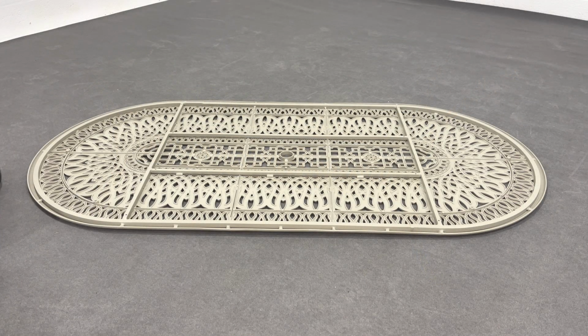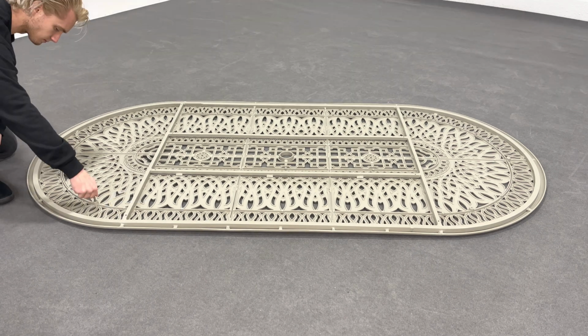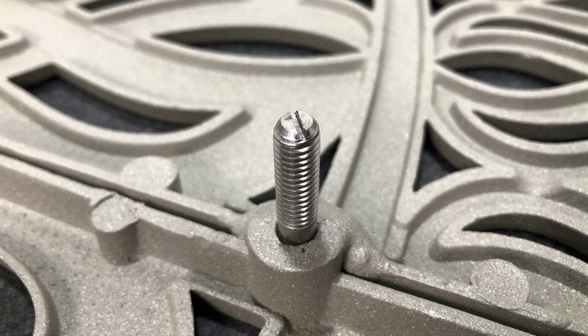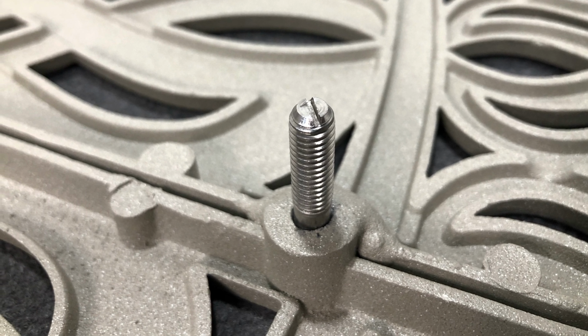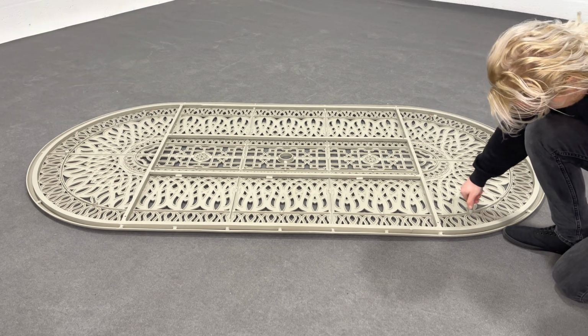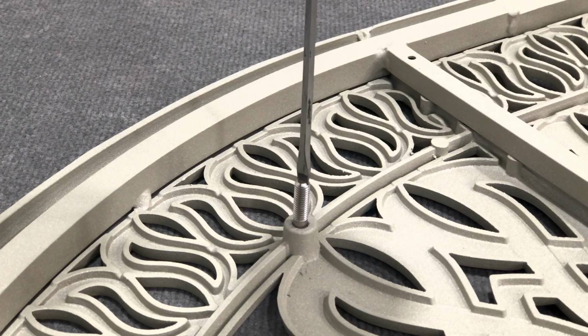On a soft, clean, flat surface, place the tabletop face down and attach the bolts. Pro tip: when attaching these bolts, ensure the screwdriver thread is face up. Repeat this process for the remaining 3 bolts. Once completed, use a flathead screwdriver to tighten. Be careful not to over-tighten, as aluminium is a soft metal and this will cause the thread to become damaged.